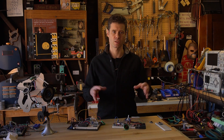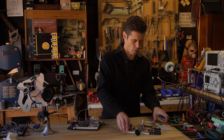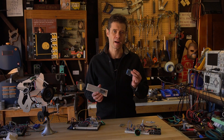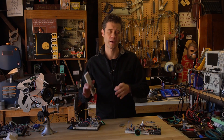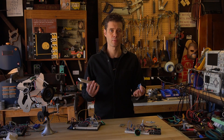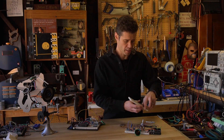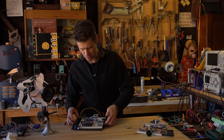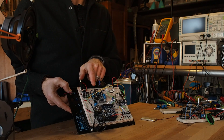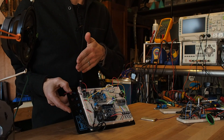With the lights and music systems combined into one, I then needed to add the audio effects. I figured I could run the output of the audio effects trigger to one channel of the 20 watt amplifier and the music maker into another. Now this would make all of those small speakers mono with the same sound, which isn't as cool, but it would be a lot simpler. So I combined them and it didn't work out so well. This board has our Arduino running the lights and the music through the music maker shield going to one channel of the 20 watt amp, and the audio effects board is also running to the 20 watt amp on the other channel.